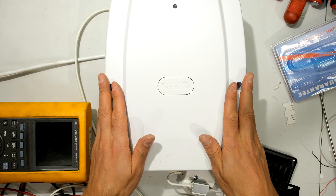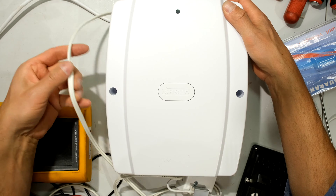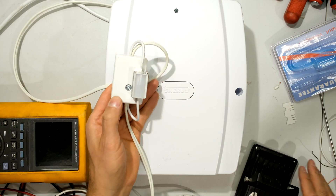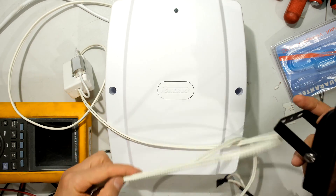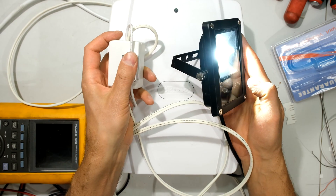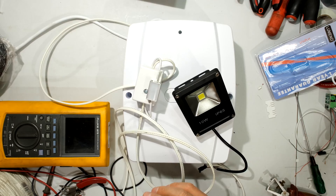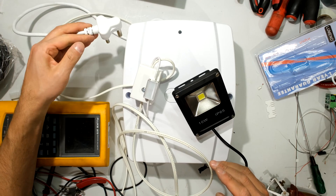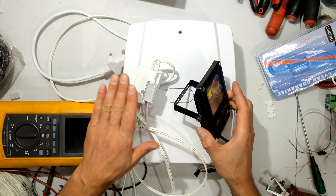This must be mounted on a wall. You can see the mains coming in, the output wire going to the day-night switch, and then a much longer cable going to the floodlight. When I cover the day-night switch, the floodlight goes on and off. And even when I unplug the mains, it will now work on the battery.